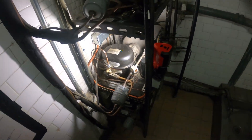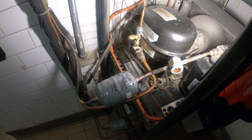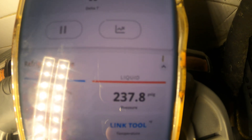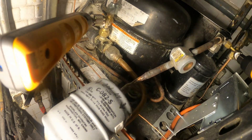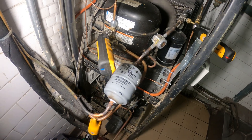Is this the easiest service call in history? Someone probably set it to 80 degrees. I mean, you can't really expect the box to be cold. I have my wireless probes on this circuit. Checking the pressures: 25 psi on the low side, about 237–238 on the high side. It says R12 on the compressor, so it must be the replacement — 134A. And 238 is very high.